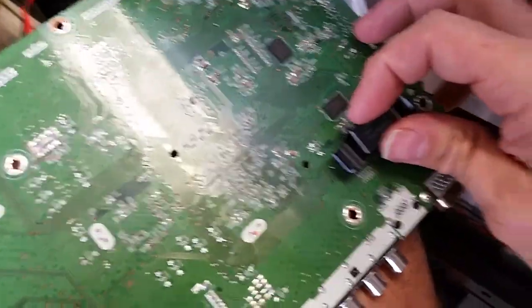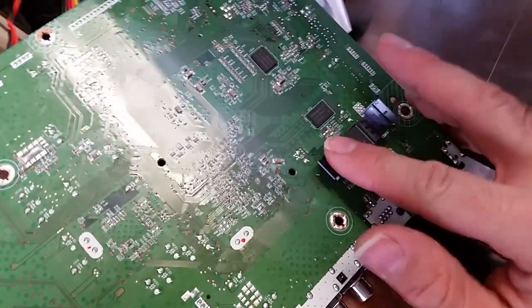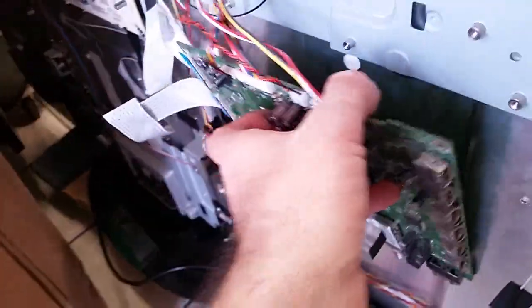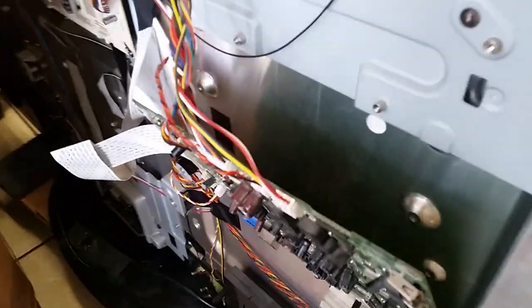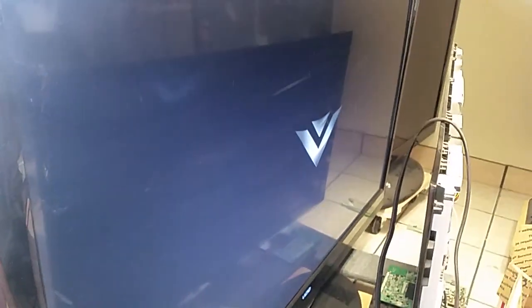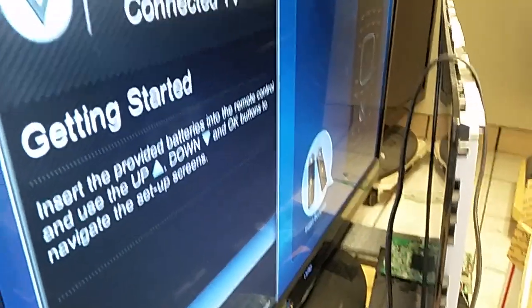On all the ones where the main memory is separated from the storage memory — where all the apps go — usually those run some version of Linux or a Unix-based OS. Where the firmware and the kernel are on a separate EEPROM and the storage is on a NAND flash, the TV can boot up and show the home screen without the storage memory. When it comes to needing it, it usually either freezes, power cycles, or something else. But those early-generation smart TVs where everything is in one chip would never get to the home screen if the memory is corrupt.